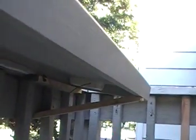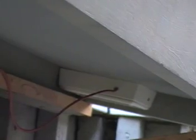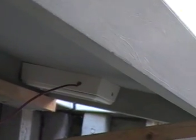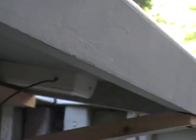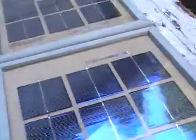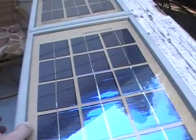On the bottom of each panel I used an outdoor electrical outlet box — basically gutted it, screwed it to the bottom of my panel, thereby creating my junction box. I simply went to an electronics store with a terminal bar that has screws in it so I could connect from my solar panel, and then from my solar panel the wire goes to my power control box. This is a solar panel made up of three parts: it has the frame on the outer side, a glass top, and then the solar panel below.